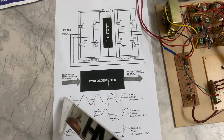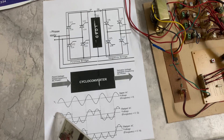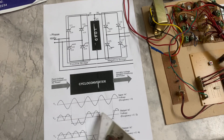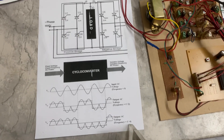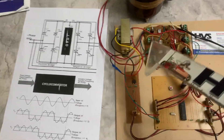You can observe that initially one cycle takes around 20 milliseconds. By controlling two input cycles per output cycle you get f/2, and by adjusting the switching timing further you get f/4. This is how we step down the input frequency to control motor speed.